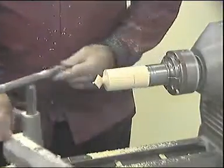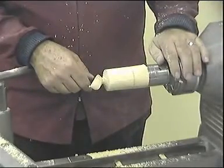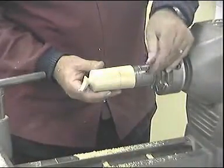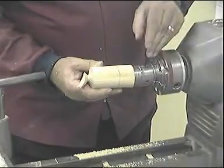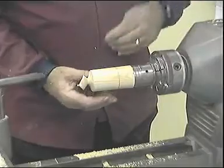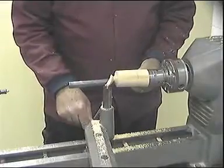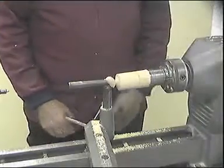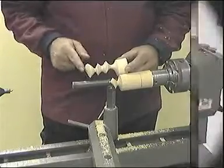Move the tool rest out of the way, check the finish, sand if required, and then we will reposition the chuck. Slacken the grub screws and align the centre mark with the grub screw in the anti-clockwise direction. Retighten. Bring the tool rest back in and check the clearance by hand. And it is now ready to create this next section.